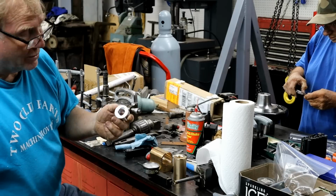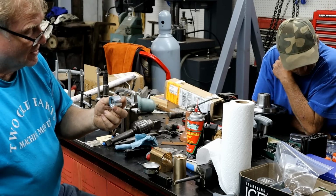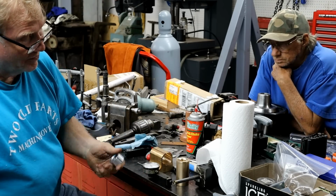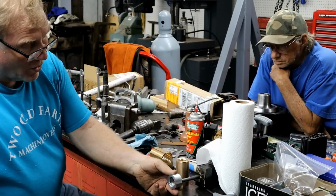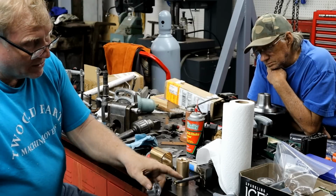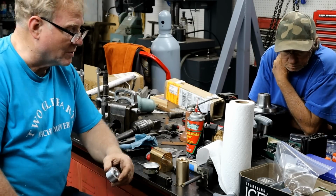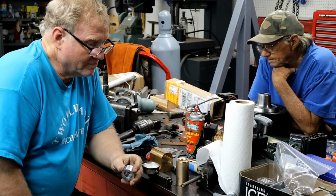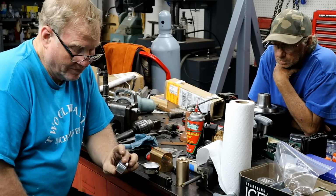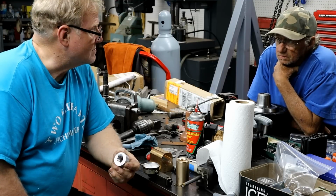That's a tough hole to thread because it's internal and it's going to be 3 inches deep. You got to have a boring bar that you can get in there with. That's about the biggest one they make. Or the smallest, longest one they make to make that nut. But it works. And if we went thousandths off of that one, it'd fit good.